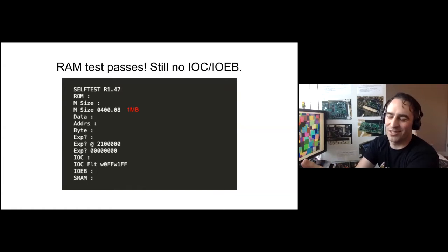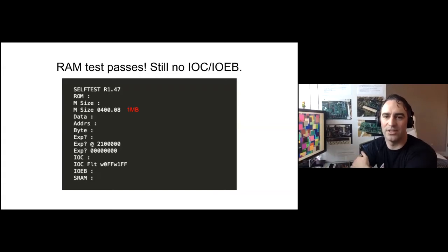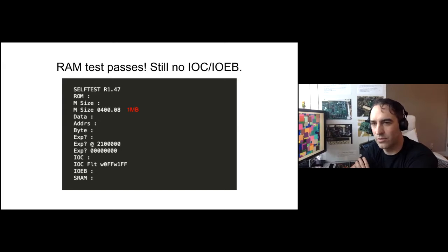Still IOC problems — a complete mystery. I buzzed more things out, soldered more wires from MEMC to IOEB for the higher address lines, but still no apparent results. Probed things, soldered test points all over the place. Just no IOC or IOEB activity. I had no luck getting anything to work reliably with the POST adapter aside from reading the self-test output. Eventually I tried writing some test code, running it using ArcFlash — my flash ROM emulator for Archimedes boards. It seemed to show some activity until I shorted a data line with a scope probe, which caused the ArcFlash board to dramatically overheat and die. At which point I got fed up with this whole project and put it on the shelf.